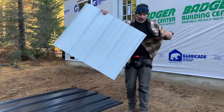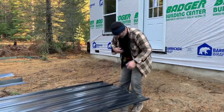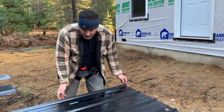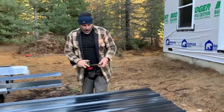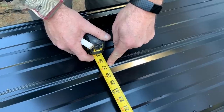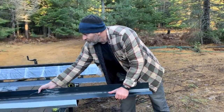We need to put this piece on first and then we'll know where we need to cut it. We drew a pencil line on here at the right height for it to squeeze in underneath the dormer. We're only cutting part of it out and then cutting up that way. We measured on the dormer — this piece needs to be 27 inches from here to here. That puts us right at this line right here.